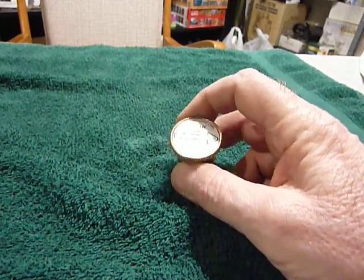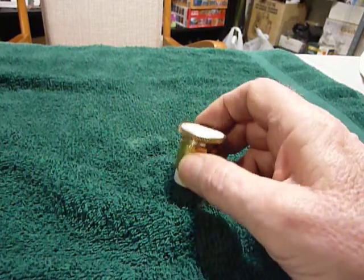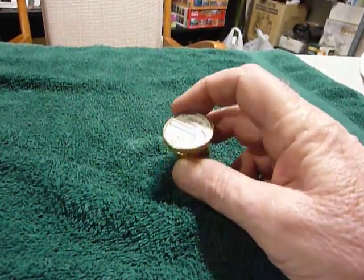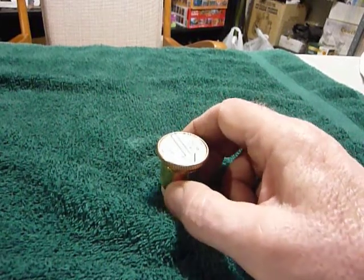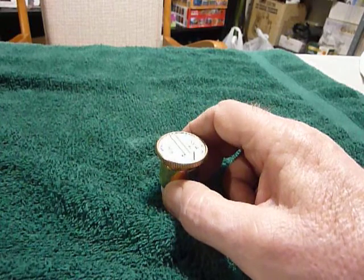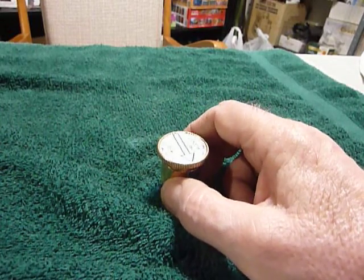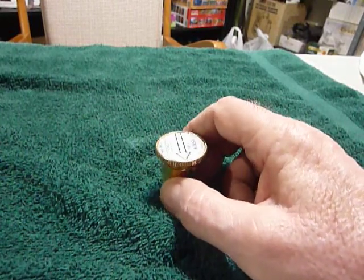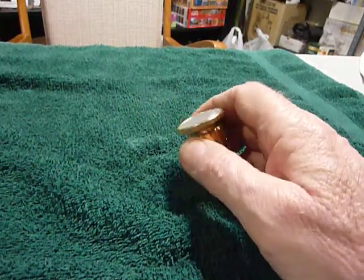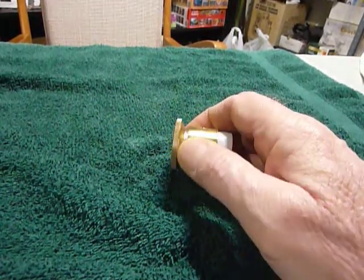This thing was shipped in the mail and was subject to vibration. I thought, what if that little pot somehow came loose — the wiper came loose inside where it contacts the resistance element inside the little tiny pot. I knew that people had had trouble with that before with these type of slugs or elements.